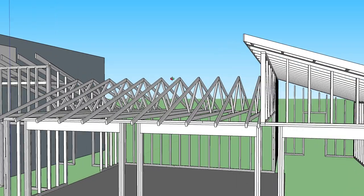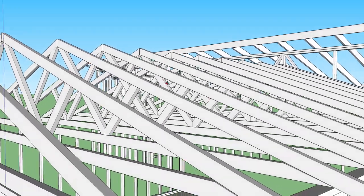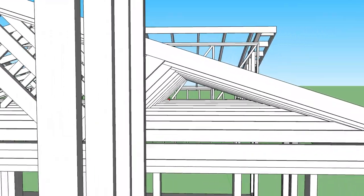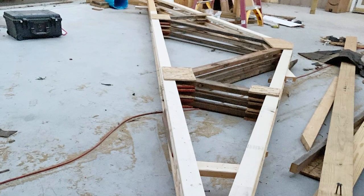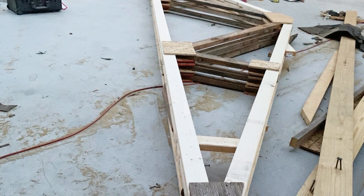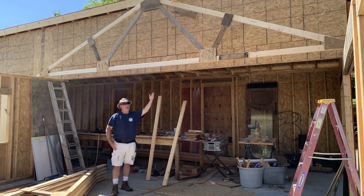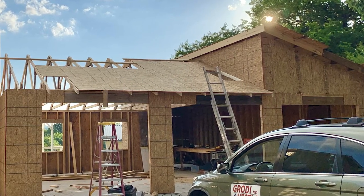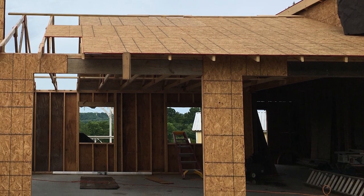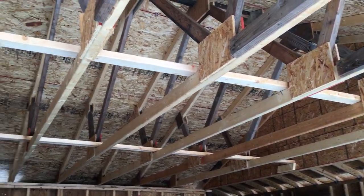Because of the design we chose for the garage, Garrett had to use trusses engineered to support a 19-foot span. Due to a spike in local construction, there was zero chance of getting trusses built in less than a year, so he engineered and built his own. Trusses have to be built to exacting standards, so it took him several days to build all 10. With Curtis's help, all 10 trusses were lifted and nailed into place. After only two days and a steady stream of Gatorades, my awesome husband had single-handedly raised and installed the middle section of the roof.